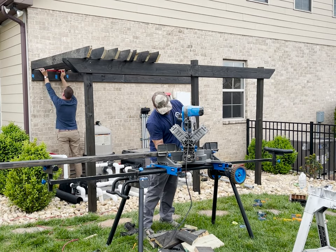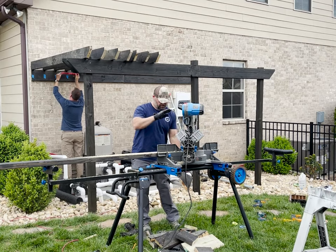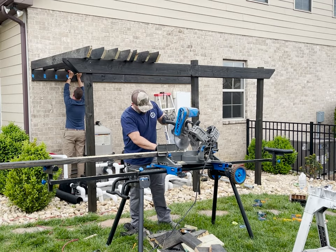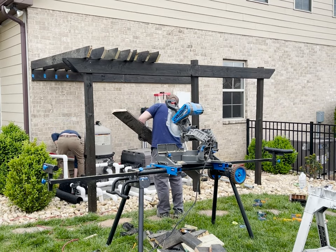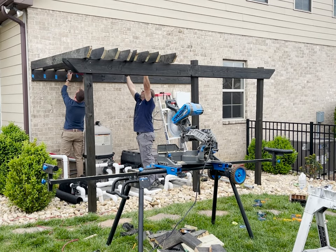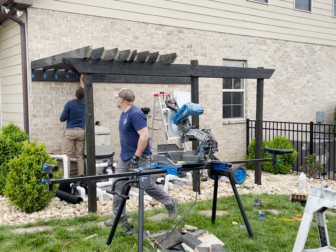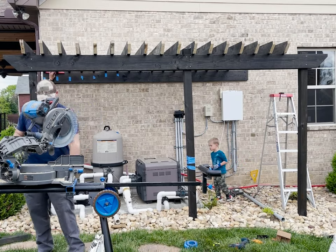So if you didn't figure it out as I was doing it — which I'm sure most of you did — here's the explanation of where I messed up. For this pergola I'll be using joist hangers that will put the top of my 2x6 joists level with the top of my ledger. So what I should have done was marked another line on the post that was five and a half inches lower than the one I marked level with the top of the ledger, which is the width of the 2x6 joists I'll be using. But I didn't do that and didn't realize it until right about now. I figured at this point we already had several joists set in place, so we should just go ahead and set the rest of the 2x6s in place and determine our spacing before we take them all down and either move the header or the ledger.